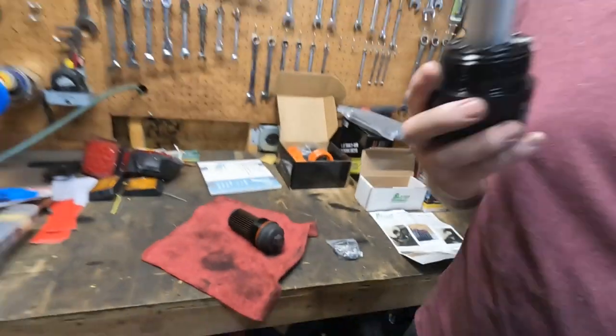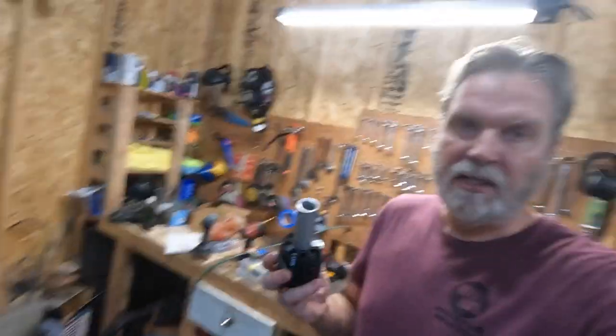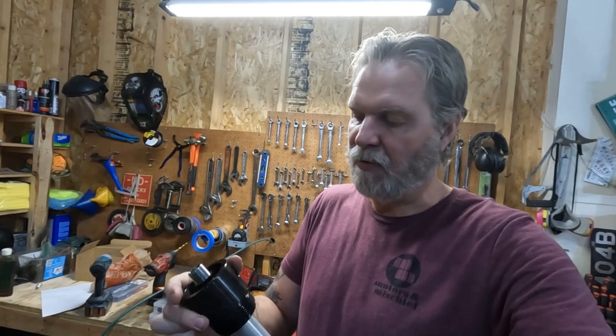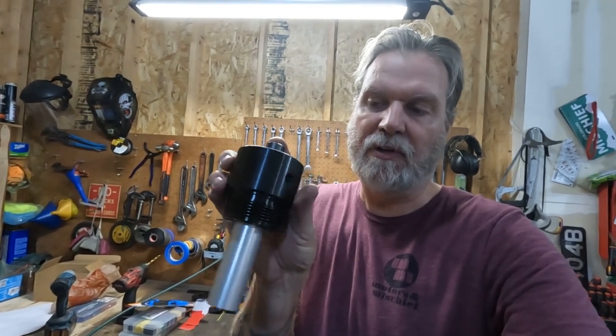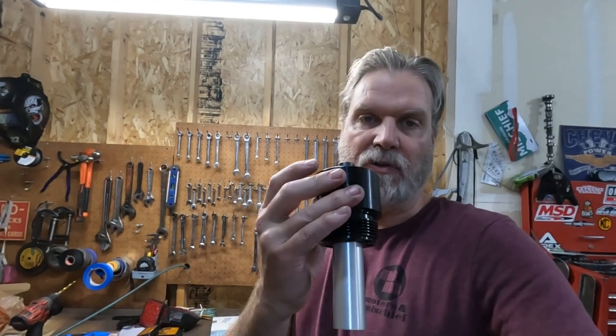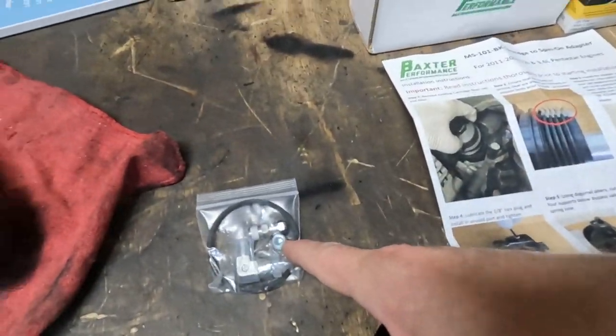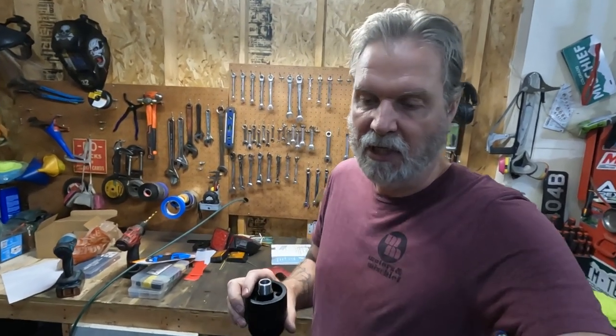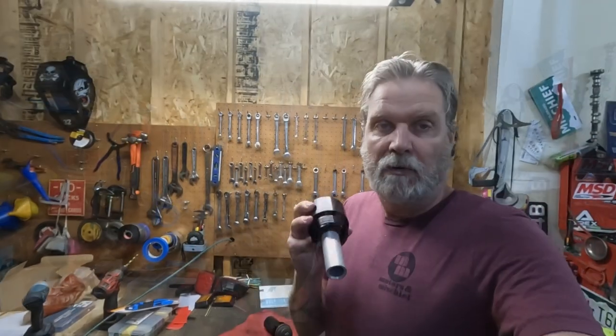Following Baxter's excellent instructions, we take the adapter and screw it in right there. You want to screw it down until it bottoms out and then back it off — make sure you don't go more than 180 degrees. The reason you back it off is to line up one of the ports for the air connection. It has two ports, one on each side — one will be in an inconvenient spot and the other will be convenient. A block-off plug goes in the inconvenient spot and the air fitting goes in the other. We're screwing in dry, no O-rings, just to figure out the placement of the air adapter.